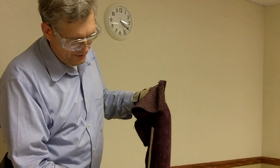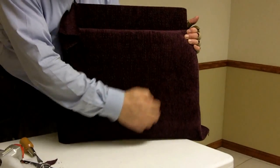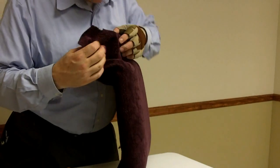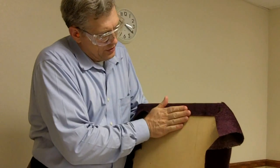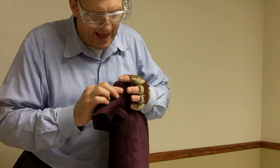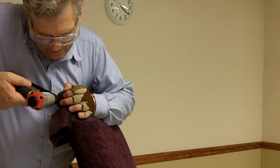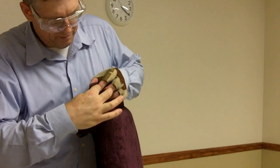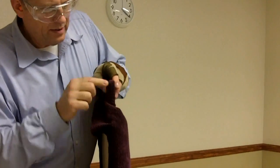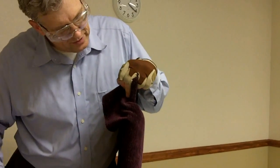I've brought the fabric around this way to get the slack, brought the fabric to the sides straight, and the grain is running centered. I want to show something about this side: I've brought it over snug and centered it. The top edge goes over flat, and then a staple goes in at a 45-degree angle. That way you can pleat this and bring it over, covering the work and making a nice clean straight line. A couple of staples here complete this side.